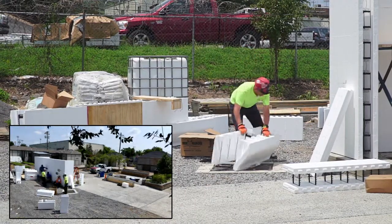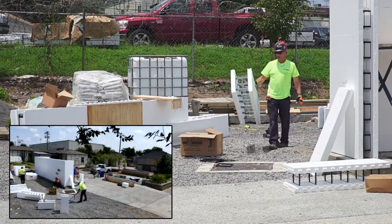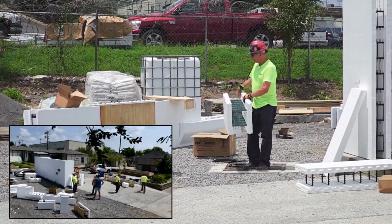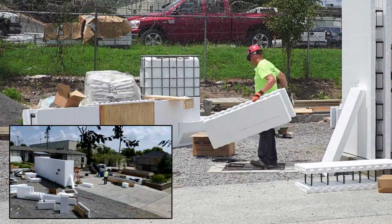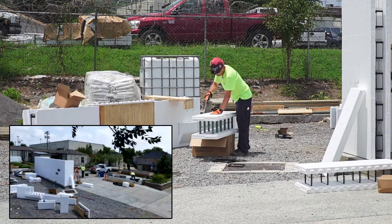That's what we did over here. Now, I'm going to show you this block, which is our curb block — this is an 8-inch curb block. I'm going to cut it, put it in that wall, put concrete in it, and pull our form off. It just happened to have all the cutting marked out.